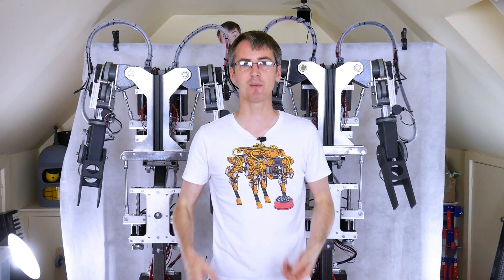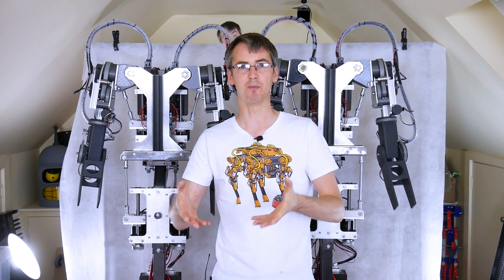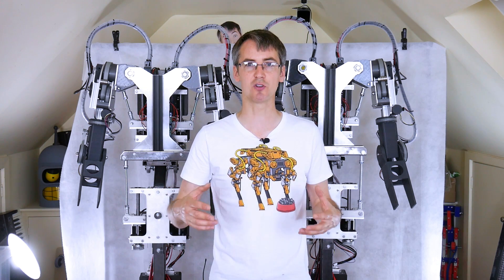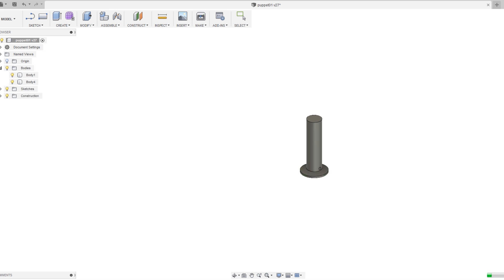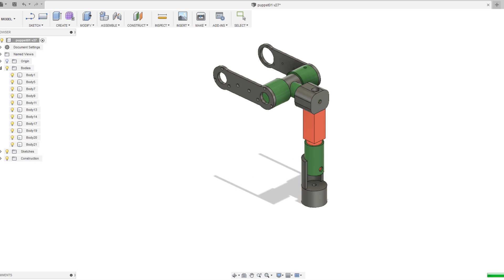Today we're actually going to make puppeteering rigs so that we can move the robots like a human moves - basically a mini version of the robot with all of the joints linked. That means we can record and play back motions to set the robots up for a performance, or people can do competitions. I need to make a mini version of the robot without motors, but with some sort of feedback pots or sensors on the joints so we can get data out and use it as a puppeteering rig to drive the big robots.